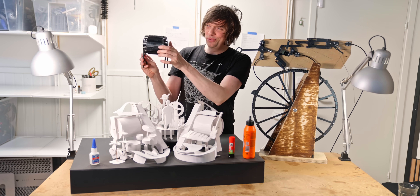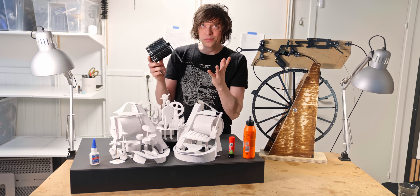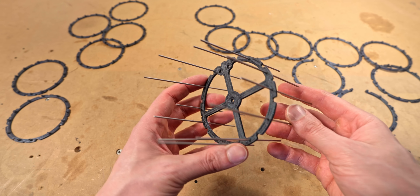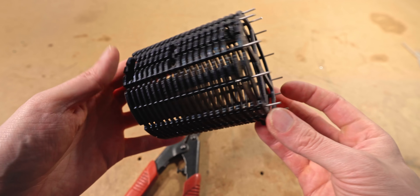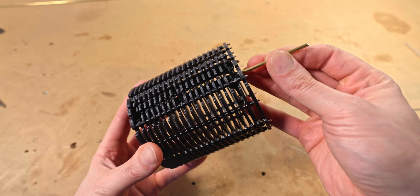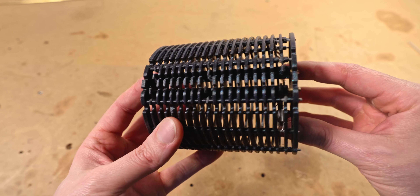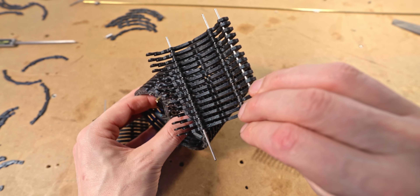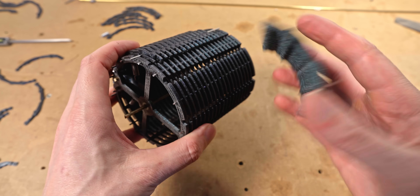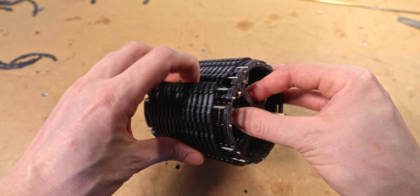I like to feel things with my hands. I printed this wheel on the printer just to get a feel for the mechanism, but we're not going to 3D print this wheel for the final machine. So how would we make it? The structure of the programming wheel we would make on a rotary CNC machine — I think all things rotating should be machined in a rotating fashion. That's much better. And then for the songs themselves, the profiles, I think those can be laser, water, or CNC cut from thin sheets of plastic. We would have a lot of these profiles, string them together into a weave with the perfect spacing, and they would snap fit right on the programming wheel structure.